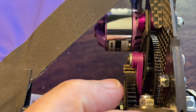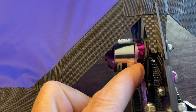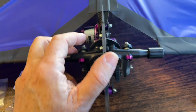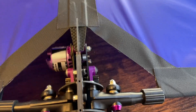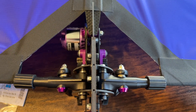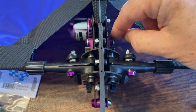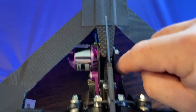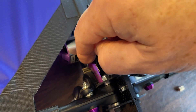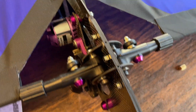These things don't glide really, but it does have these glide lock arms — these differently colored 3D-printed arms. They're gravity-fed: they slip down, gravity pulls them down, and they hit little notches which locks the wing in glide mode so you can control it a little bit when you stop flapping. When I got this, these were too tight and wouldn't move. You want them to freely move so that every time the gear spins around they flip up on the little notch and lock in place, which happens when you go into glide lock.